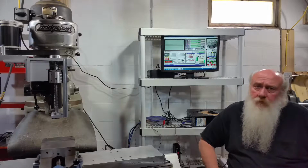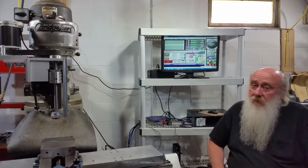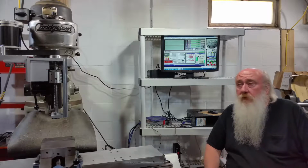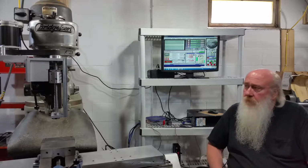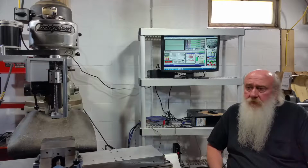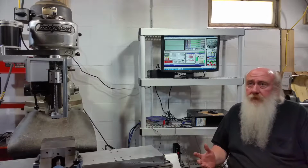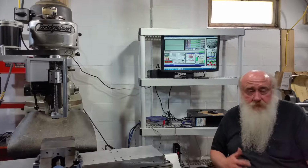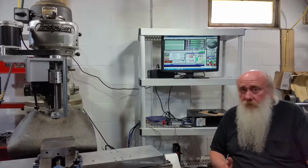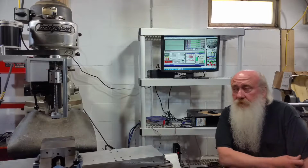So after talking to some folks at work that deal with our machines there, the electronics and the programming and stuff, I think we narrowed it down to noise. I'm hoping that's what it is. I was just jogging it around earlier today, and it seems to be okay. We'll see. That could have come from anything. A microwave upstairs, but what I'm thinking is it was during the winter and the pellet stove was always running. The fans, I think that's what the problem was.